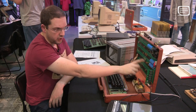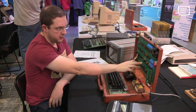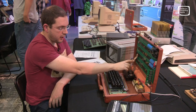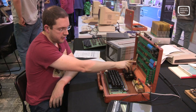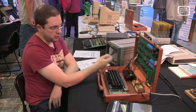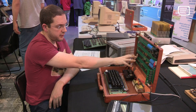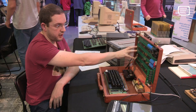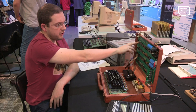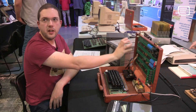You've got the lower 4K of memory and upper 4K of memory — some original boards only shipped with the base 4K. There's your memory decoder and address decoder, the 6502 CPU, keyboard interface, and then the two ROM chips down there are the monitor ROMs — 256 bytes on board.